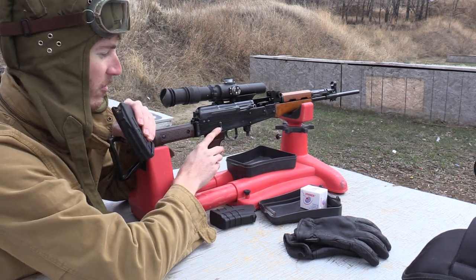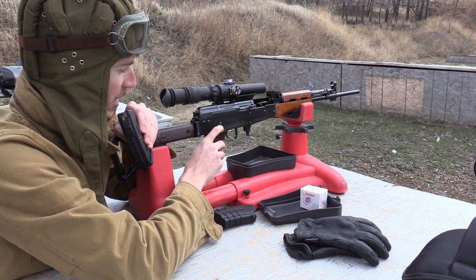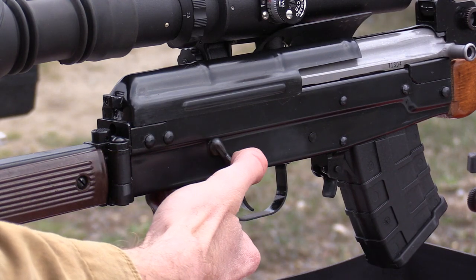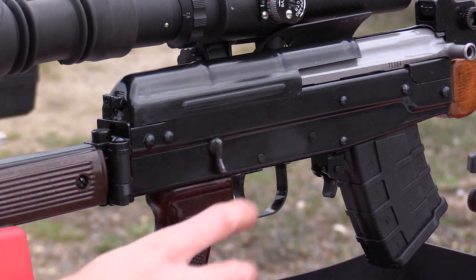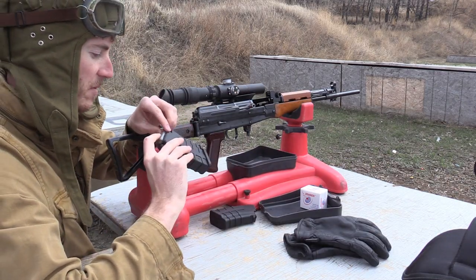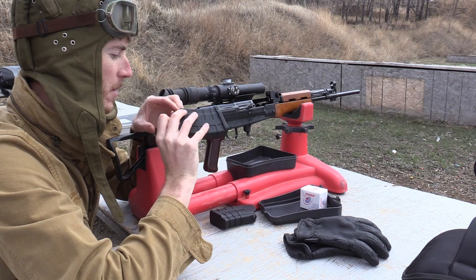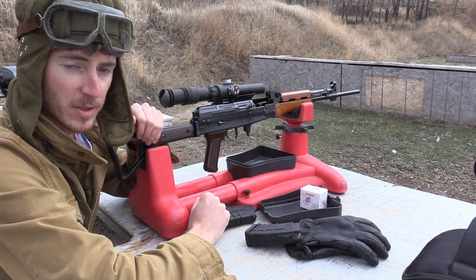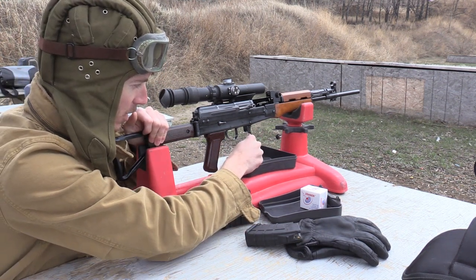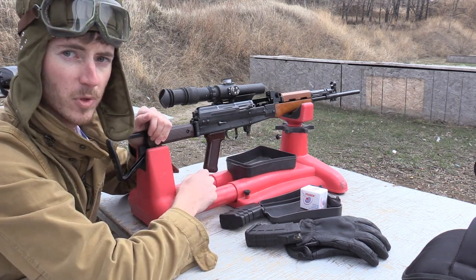Since the last time you've seen Q-Sun, I've made two modifications that I didn't videotape. One is that I fabricated a safety for the firearm — a 90-degree throw safety that turned out pretty good. It totally solved the red spring plate coming loose out of the receiver that you noticed before when shooting Q-Sun without the safety — that's now fully retained. The second modification was removing the mag release and bending it more straight, hopefully to aid in Spetsnaz-style reloads and make them a little bit easier.